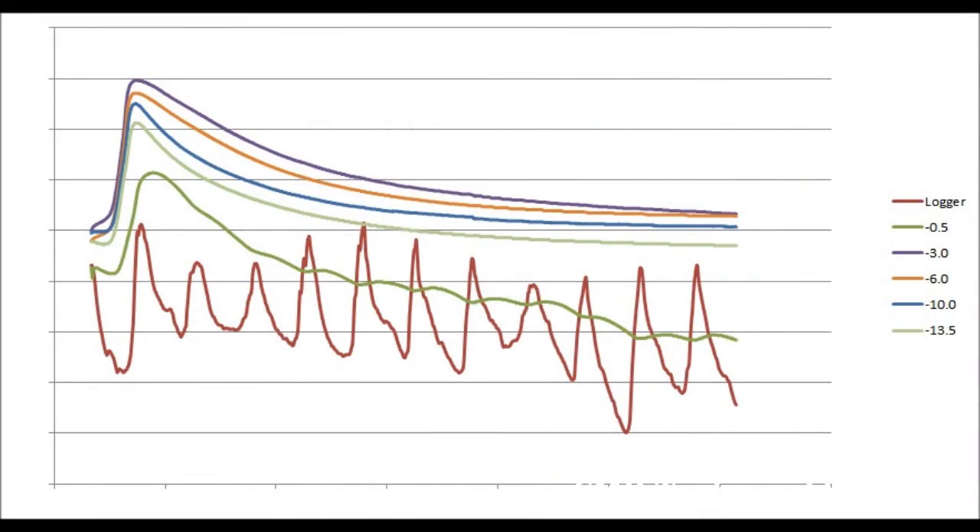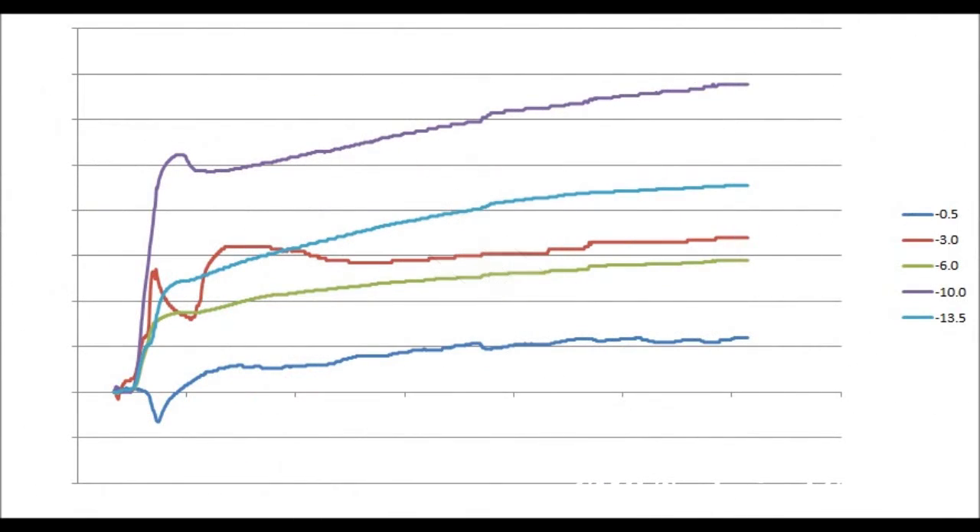The downloaded data is plotted up. Here is a graphical representation of the temperature profile at the various depths and also ambient temperature while curing. Here we're also seeing the strain development at the various locations along the pile shaft.